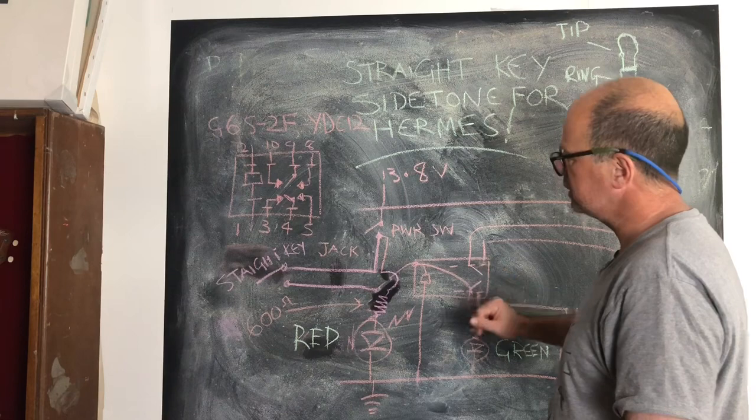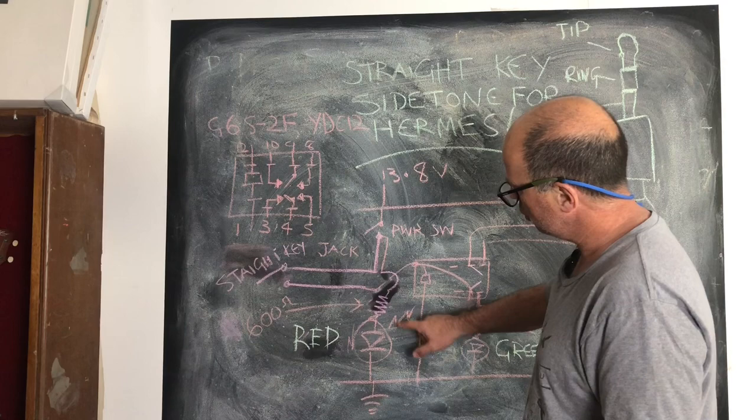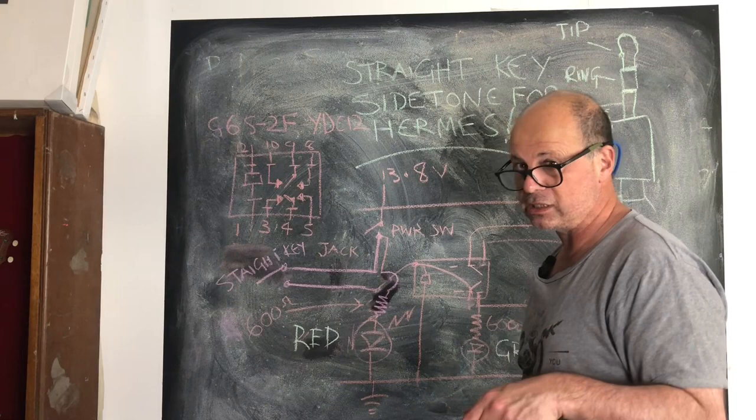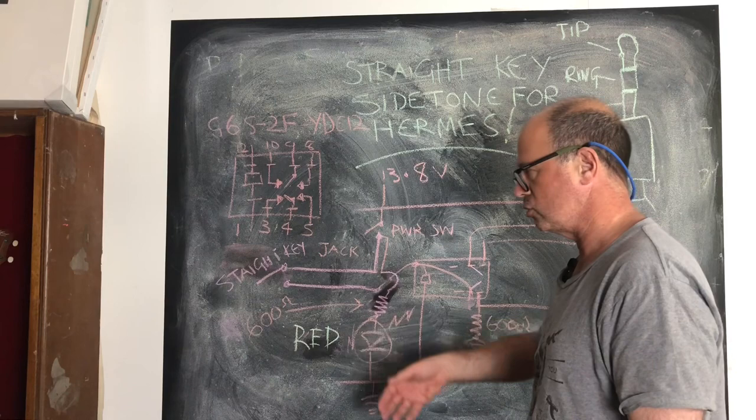And we've also got attached to this power switch, when it's switched on, a 600 ohm resistor and a red LED, written in green, quite unhelpfully. And so the 600 ohm resistor, I just cobbled together some resistors to get close to 20 milliamps of current. So you can do your current equals voltage over resistance. 13.8 volts over the resistance in ohms will give you your current in amps. And so you should get 0.02 amps. That's your red LED. So that comes on when the power is applied.